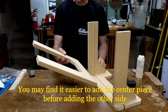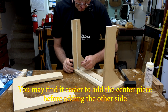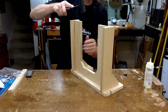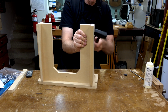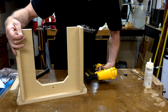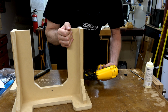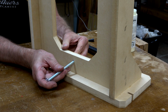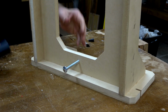The next piece to go in is what's known as the base center. And a few brads in this to make sure it's going to behave itself. Next, I'm going to take the 5/16 by 18 4.5-inch carriage bolt and insert it into the pre-drilled hole here in the base. If you need to, come in and give it a little love tap with a hammer there.